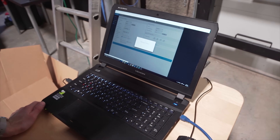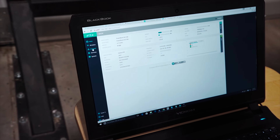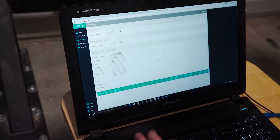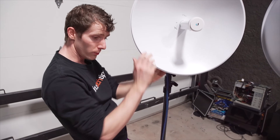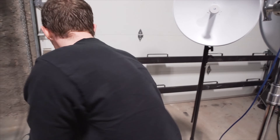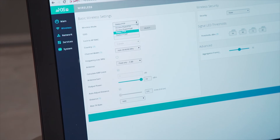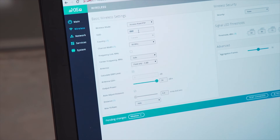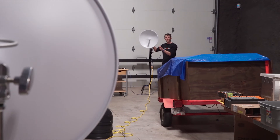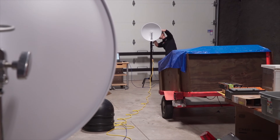It is highly recommended to configure these while you are still very close to them, not after you've deployed them 25 kilometers apart. We're logged into our second unit now. We'll set up the network settings differently from the first one - instead of .64 we're going .66 - and put this one on the main network. On the last step: go to wireless on the second unit, set this one to 'access point peer-to-peer', use the SSID 'long-range', leave everything on auto, and turn the output power down.